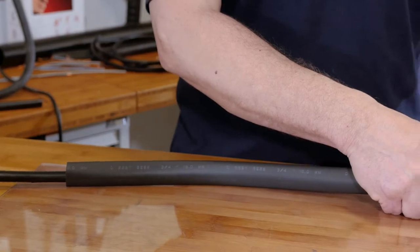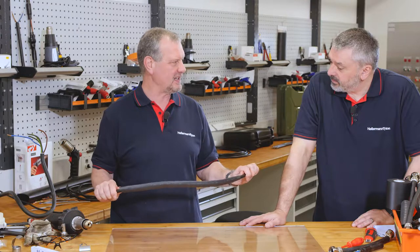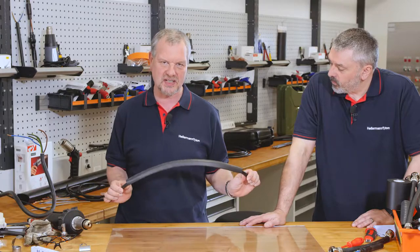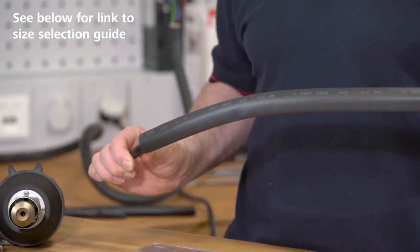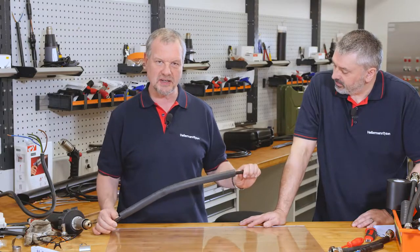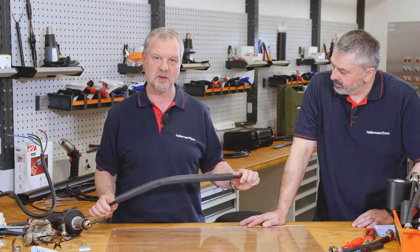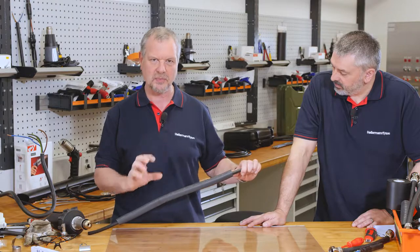How do we know it's the right size tubing, Mark? We know it's the right size tubing because we'll actually measure the ID of the cable, and then we'll get the tubing. This tubing actually shrinks — it's got a shrink ratio of 2 to 1 on SE28. So this falls into our 80-20 rule. The 80-20 rule means that we have a tubing that will shrink just slightly more than the ID you want. So if you've got a cable that is 10mm, really you want a tubing that will shrink down to about 8mm, so it forms a nice grip on the cable.